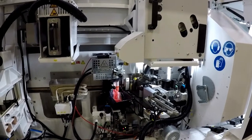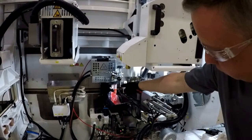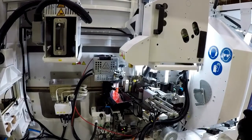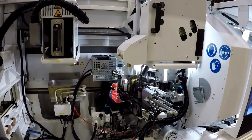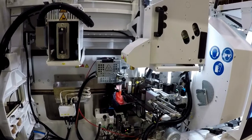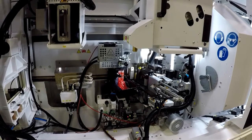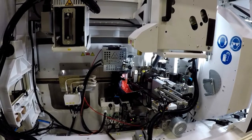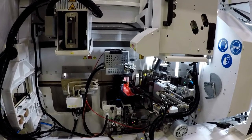The glue roller will stop at different times to allow the cleaning agent and the rest of the glue to start to move down into the channel here, which has a heating element behind it, and there's also one down into the roller so that we're keeping an even temperature on that roller at all times. As this continues, you can see in the beginning there was more of the white glue with a little bit of the red — now, as it continues, you're going to see more of the red with less of the white until it becomes basically all red.